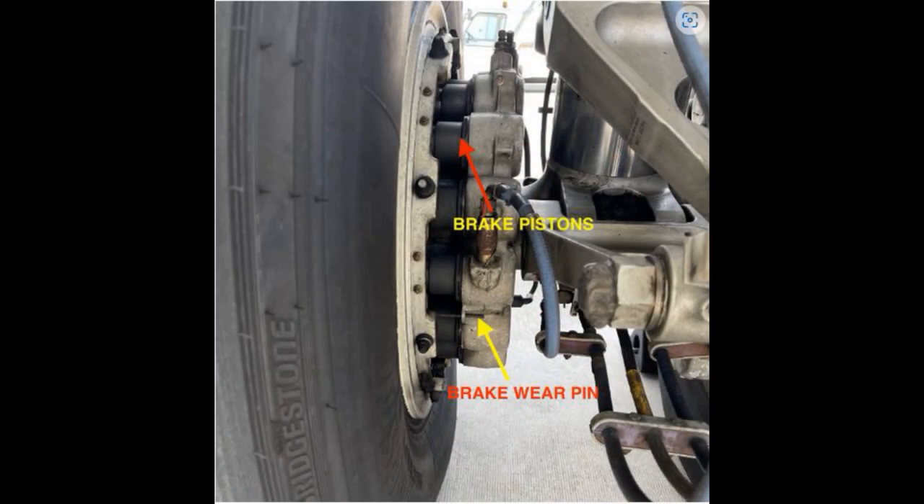There are a number of ways to identify worn brakes and prevent brake rupture: individual checks, inspections, and taking precautions when using de-icing and cleaning fluids. We are in the type of year now where de-icing will be used at certain parts of Europe — particularly during the ski season. A lot of this we can't control because we have to taxi through the fluid; we leave a lot to the de-icing crews who have their own operating procedures. But the key awareness point is: regularly check the brake wear indicator. The maintenance planning document requires a regular visual inspection of the brake wear indicator to assess the thickness of the brake disc material.